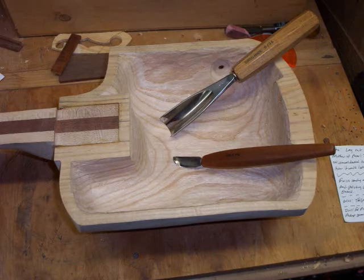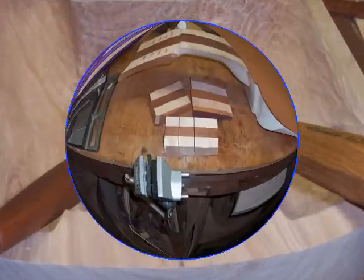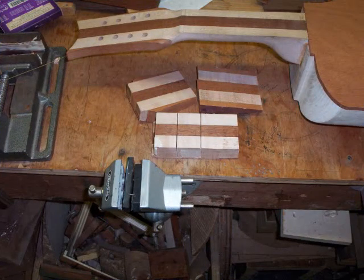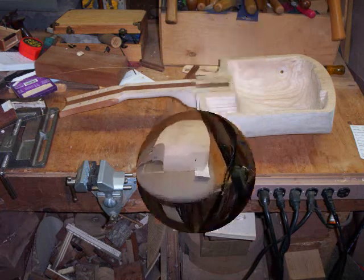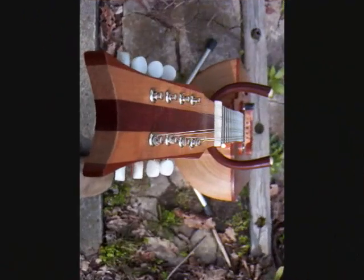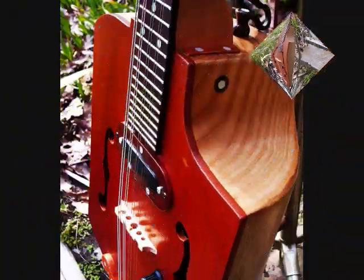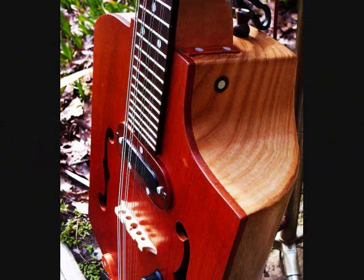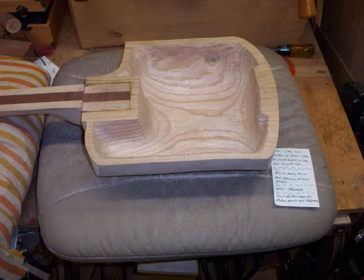My mandolins are dug out from the log, breaking away from the modern archtop design. The neck is made up of mahogany and curly maple. After the glue is dried, the neck is cut out, shaped, and drilled for the machine heads. Then it's sanded. It is now ready to be mortised to the bowl body. Then the body and the neck is drilled to accept a lathe-turned dowel of black walnut. Then the dowel is inlaid with mother of pearl.